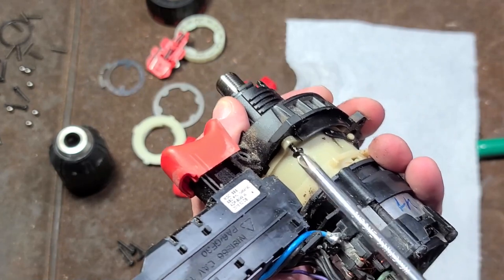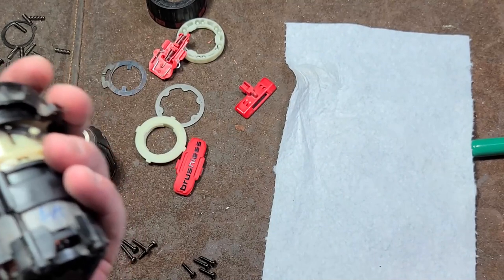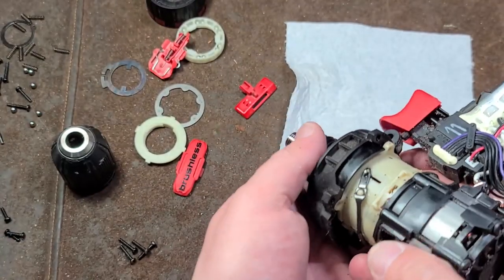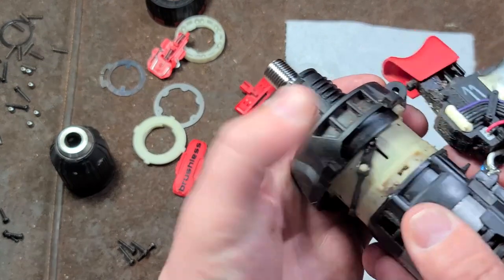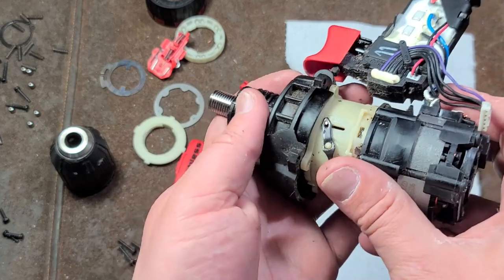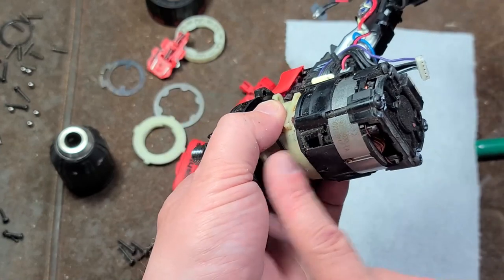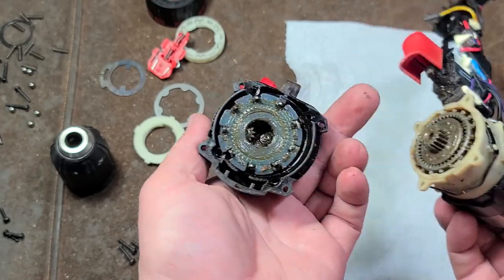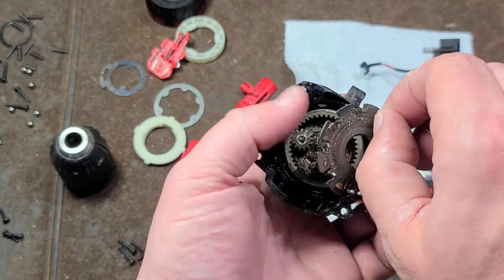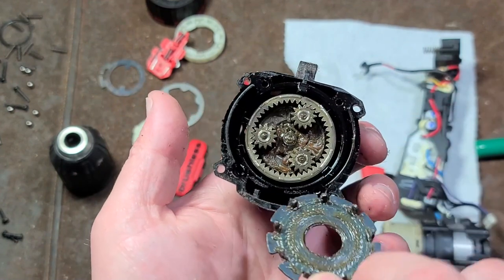We'll magnet that whole pile out of there. We have a little washer — I like to keep those, they're handy. I usually keep the rollers just for the fun of it. As far as what's holding the spindle in, I don't see any pins or anything else, so that must be a friction fit. I'll use my favorite tool — a hammer — and give it a little whack. There's our spindle. For a half-inch drill, it's a surprisingly small spindle.